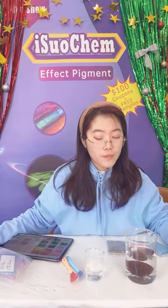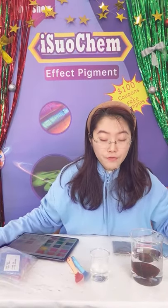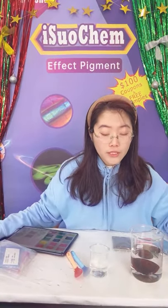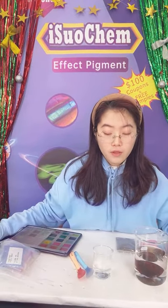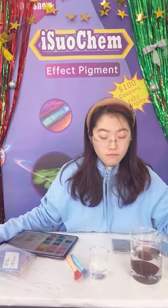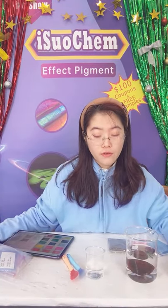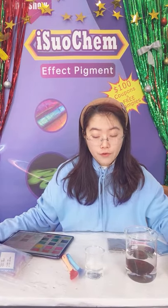And we have been talking about the color and the form of change. In fact, the most important cause of discoloration is temperature. And to meet the needs of the public, we have developed thermochromic powders with different temperatures. Our temperature range is from 0 degrees to 65 degrees. For different applications, you can choose different temperatures.